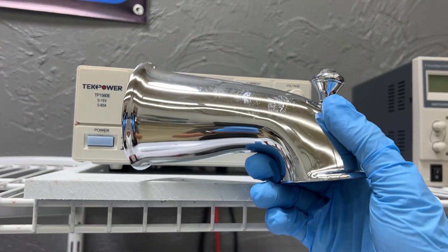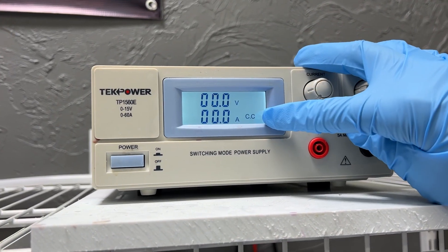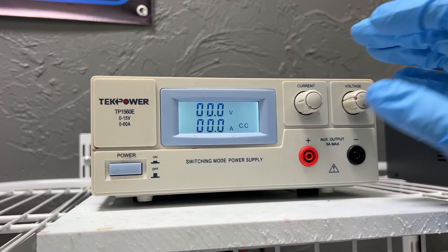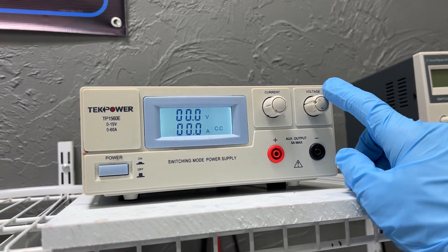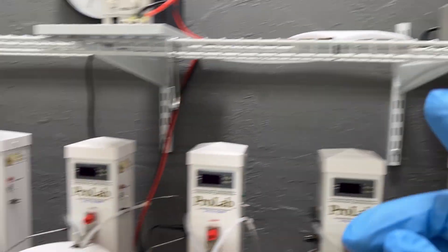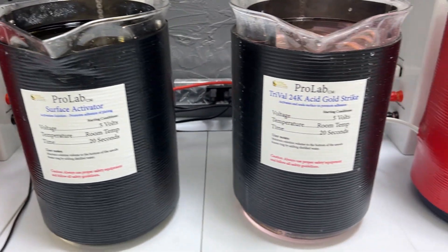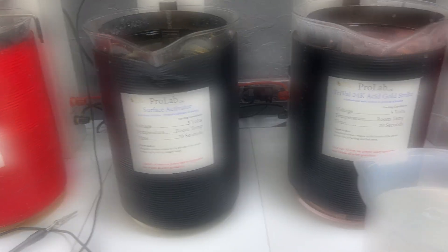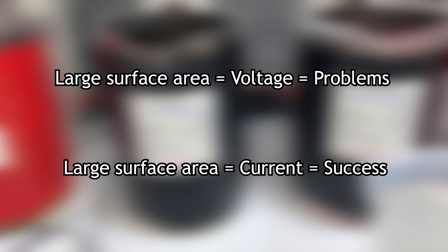If you are looking to achieve a certain thickness with your final plate, we recommend current driven because it is more consistent and predictable, whereas with voltage the amperes fluctuate. For larger parts with more surface area we also recommend current driven. If you're not familiar with how to determine what your current should be, we have that information on our website and you can also email us, call us, or visit our Facebook page. Voltage driven is safe for smaller setups such as the Jewel Master and for activation steps like electro cleaner, surface activator, Woods nickel, and our Trival, but as you plate items with more surface area, voltage becomes less successful and more problematic.